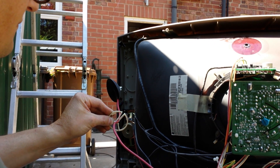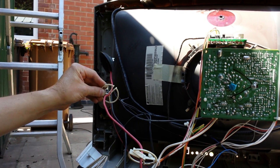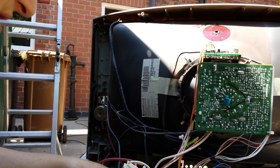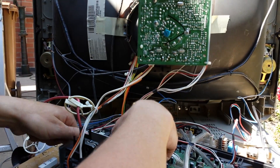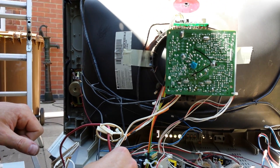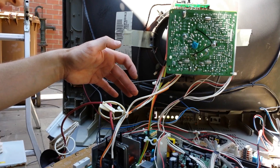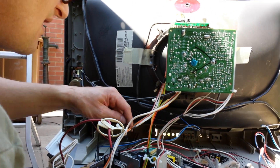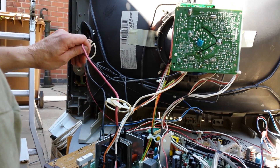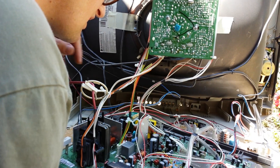Just see if anything's getting hot. Unplug — safety first, as Larry HDFX always says. Always keep your hands away from DC caps, guys, whenever you're inside these TVs. Because these DC caps, even when you've turned off and you arc out to earth, they'll still hold the charge because of all the diodes and everything else.